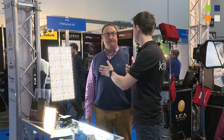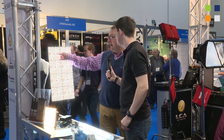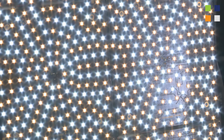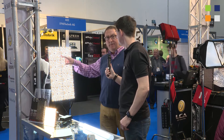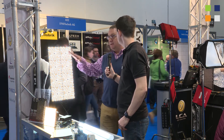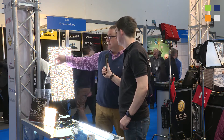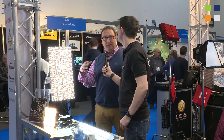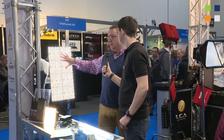So over here you've got another piece of kit — tell us about this. So this is a product called the CineTile. You can probably tell from the camera that the LEDs are arranged in a circular fashion, and in the middle there's a little CCD sensor. It's using the same 2700K and 6500K LEDs, but the reason everything is shaped in a circle is because it minimises the multiple shadows from lots of LED sources. This little CCD sensor is monitoring the colour temperature and keeping it static throughout the day.